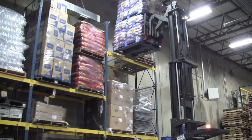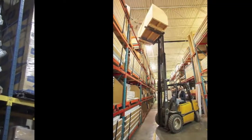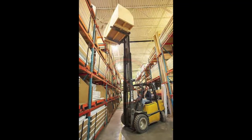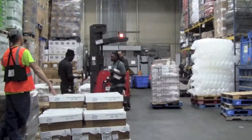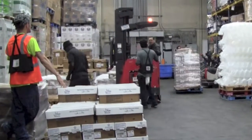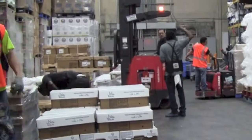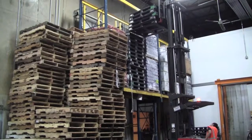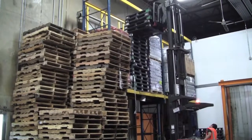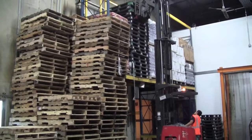Remember that your stability is affected with the load up high, and so you should never raise the load while traveling forward or turning toward the platform. In the event your facility layout or design space considerations prevent you from doing these maneuvers, make sure to take it slow. You are allowed to keep the forks at waist high, for example, when unloading by hand to assist in ergonomics or back safety. However, keep these maneuvers the exception and not the rule when loading and unloading in and around your facility.